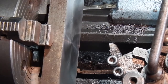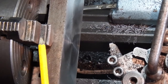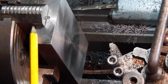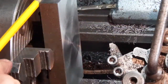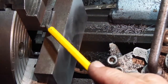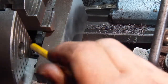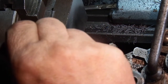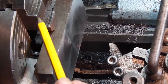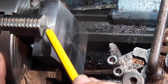I've got this in the four-jaw chuck. It's held on this side by the jaw the normal way, and on this side I've put the jaw in backwards so it's resting on this face on the back. I couldn't put these in backwards because being narrower the inside of the jaw would be touching the opposite side and it wouldn't close down to grip the part. So I've had to leave two normal and two reversed jaws.